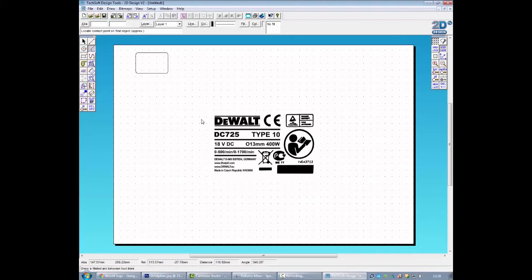If you've got a graphic or a curve or something like that you want to do in 2D design or Photoshop, as you've got a black and white etch like this, you're going to have difficulty if you're going to apply it onto the model and then laser etch it if it's not flat and level with or parallel with the bed. So think about that. If you've got some really complicated graphics like this, there's no way I'm going to unpeel this masking tape and then apply it to a curved drill and then spray onto it. So that's one of the limitations we've got.